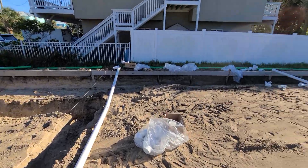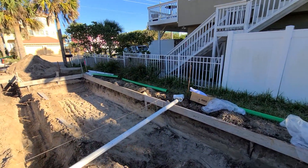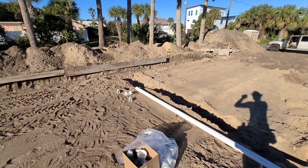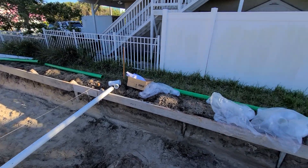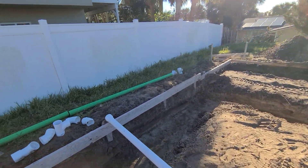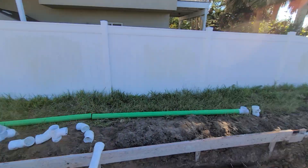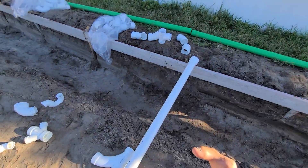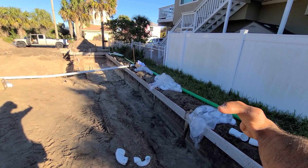That's how we're gonna have this thing set up for now. I think I need to pick up a couple more fittings because I don't have 2-inch fittings there, but it's pretty much 95% done. We just have to figure out the grading of the pipe — the main sewer line. That's the main thing I've got to figure out, and once I get that graded properly I can set all these lateral lines in and know how deep I have to dig down.